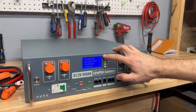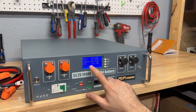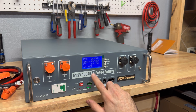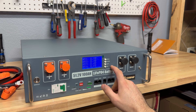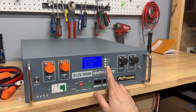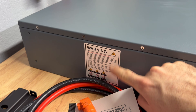Turning the battery on, the LCD screen has four options: Pack Info, Pack Status, Pack Para, and Pack Set. It shows voltage, current, capacity, state of charge, remaining amp hours, and FCC — which reads 105.2, so that might be the actual cell capacity. There's a cycle counter, four temperature sensors showing all battery temperatures, and individual cell voltages under Cell Info, so you can easily spot any problem cell.